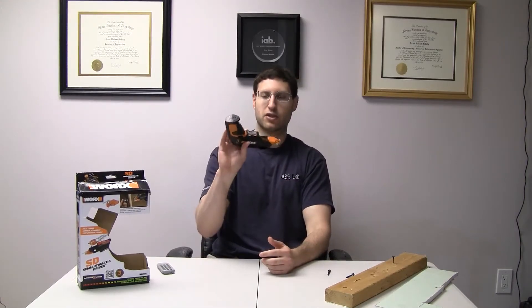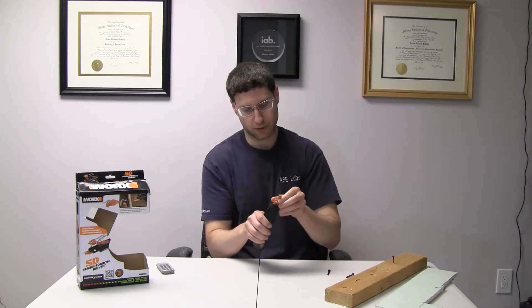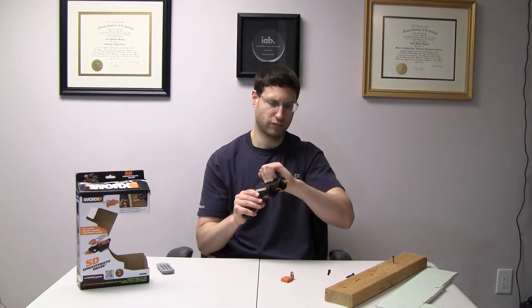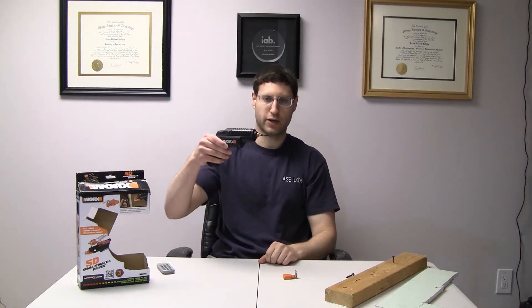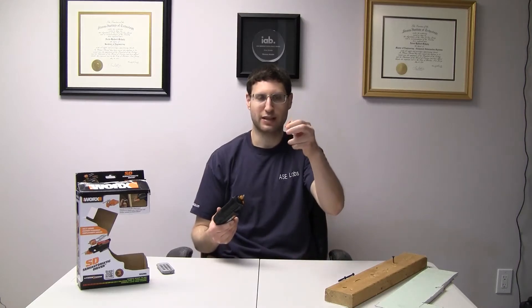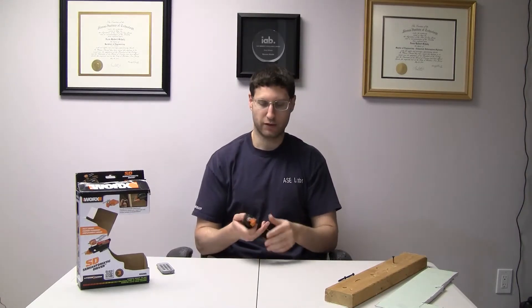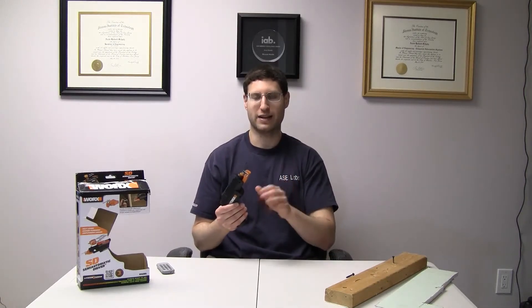There are two model types — one comes with this screw holder. There's a little release here, push it and it comes out. The other model does not have the screw holder. So let me show you something: if you have this drywall screw and want to put it somewhere above you, magnetically it'll hold, but if it's going up that's a problem — that's where this thing comes in. Put it back in and lock it, then hold it like this. These little teeth grab the screw — put the screw in here and the teeth hold it. I can't tell you how much better it is to not have to hold the screw when you're working like this. Great idea.